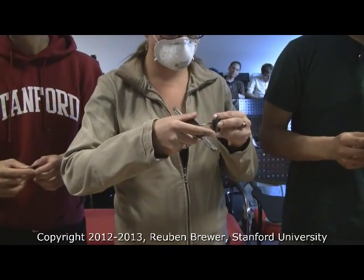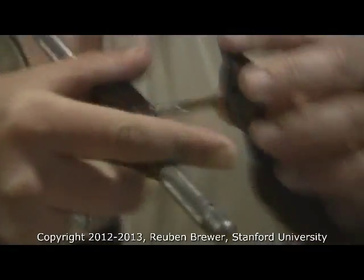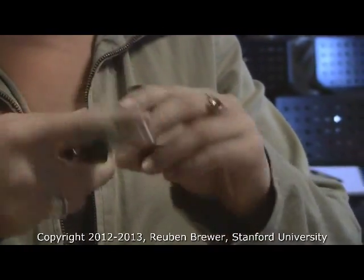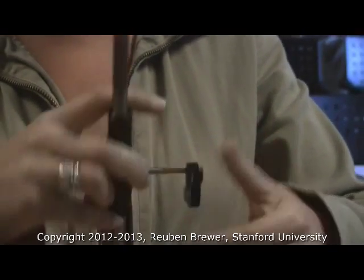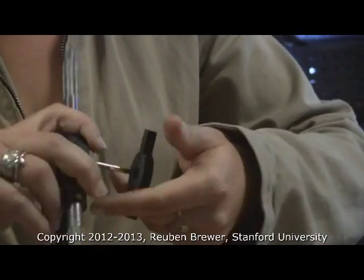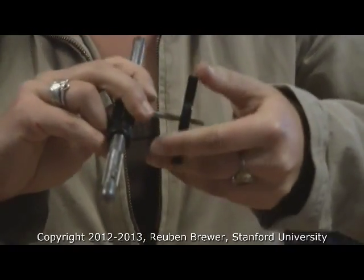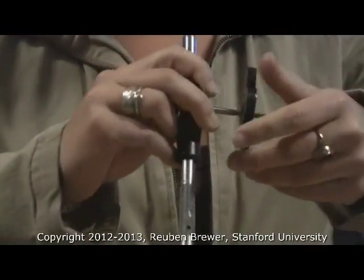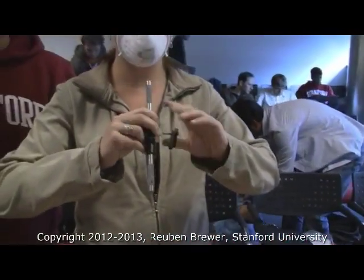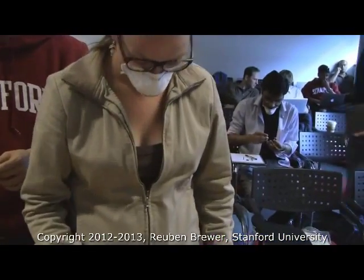By the end, everybody should have one power-tapped hole and one hand-tapped hole. Put the tip in before you start it — kind of slowly. You're lined up. Go until about four threads are left. Everyone's hand-tap might not be pretty — hand tapping is pretty hard. For those power taps: can you do it through metal? No, very bad idea. You need a proper metal tap. We'll talk about that, but in practice people sometimes make you do it when you've got 10,000 of them.